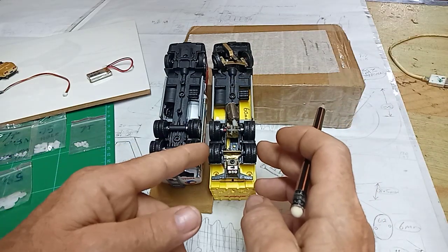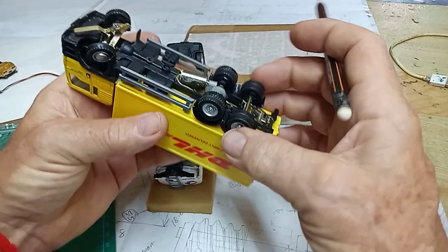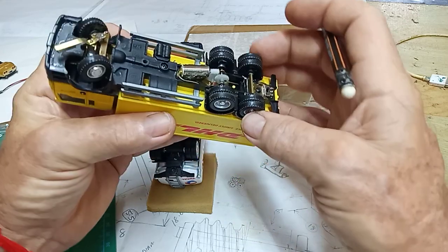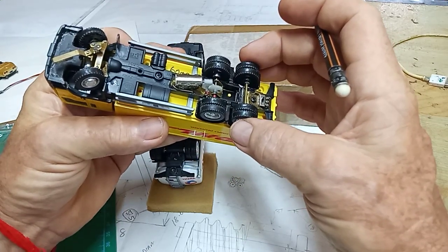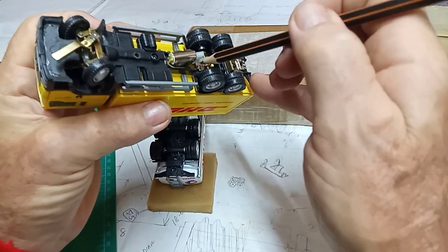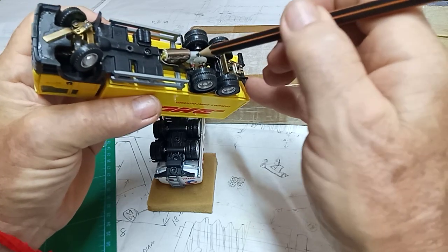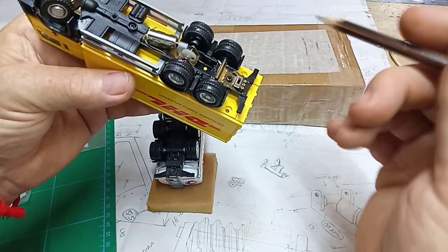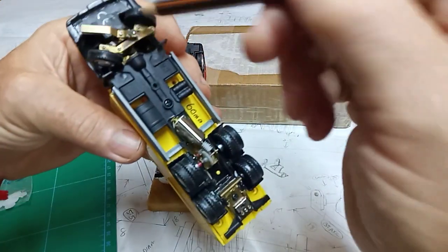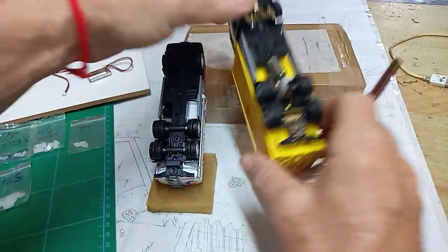On the back, the rear wheels, you want them free floating if they're not driving, so they can go up and down and sideways. So that's just a folded piece of brass with the 1 mm axle, a 1 mm idler axle inside these gears. Very simple. So I've only made that attachment, the gear drive assembly and the steering, and attached that to the original model.